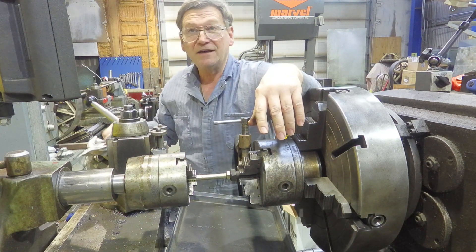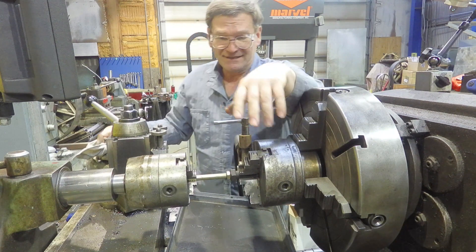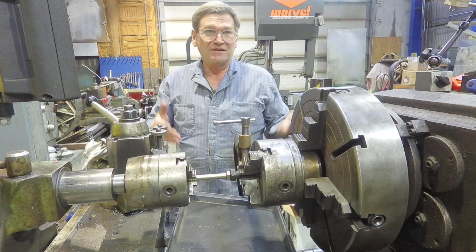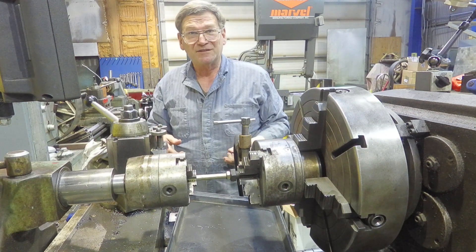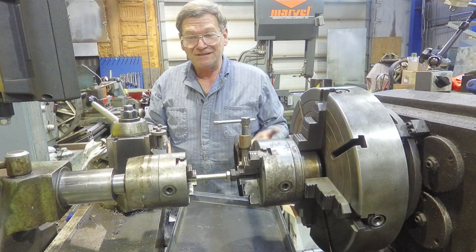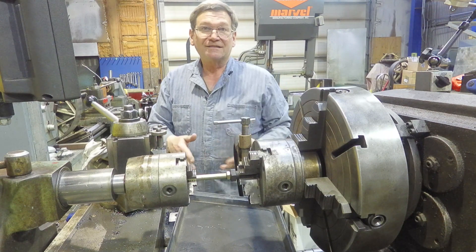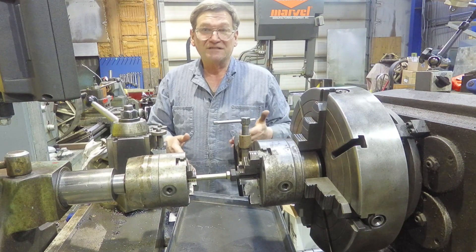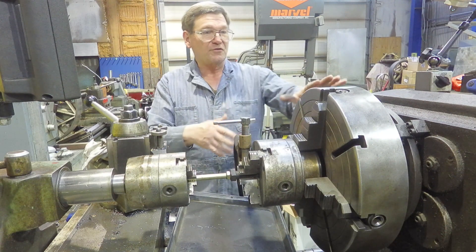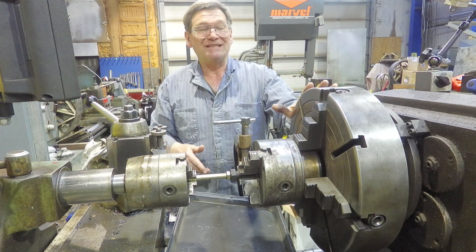But if you strike an arc on this piece first, that arc is going to travel through these bearings and all the rest of the machine — and that's bad. What's really bad here is you're welding with a hood on. Some machinists have done a lot of welding; some haven't done much yet. The machinist who hasn't done much can easily accidentally hit the tool post with the stick, which won't ruin the tool post directly, but you've got all that current going through the bearings. Most of the time they don't get damaged.